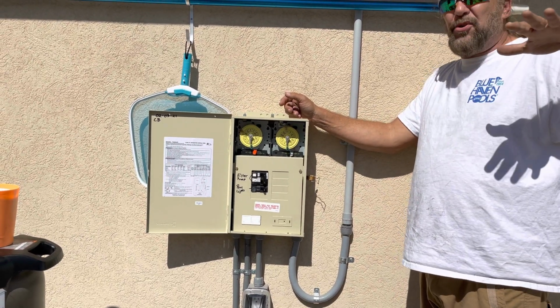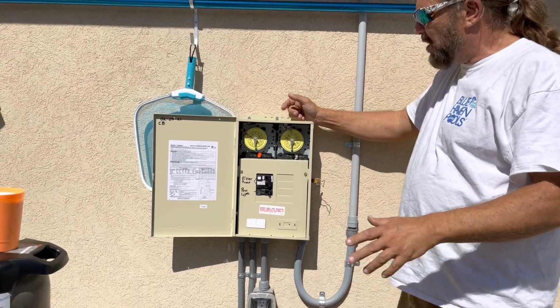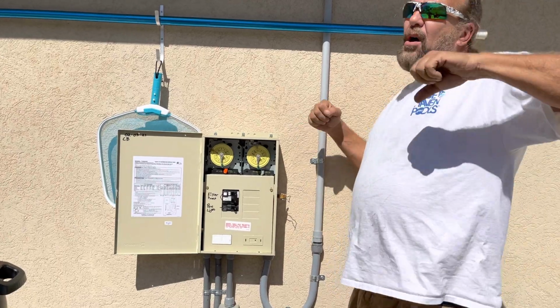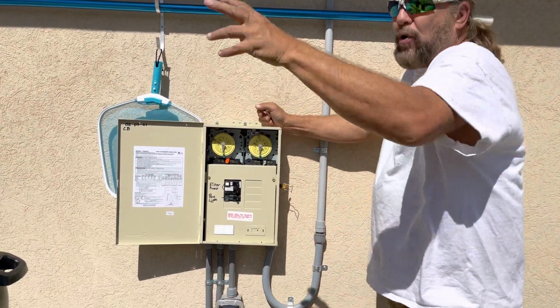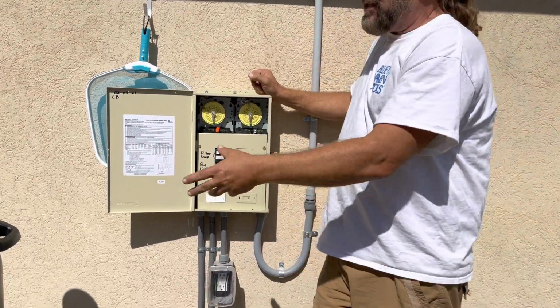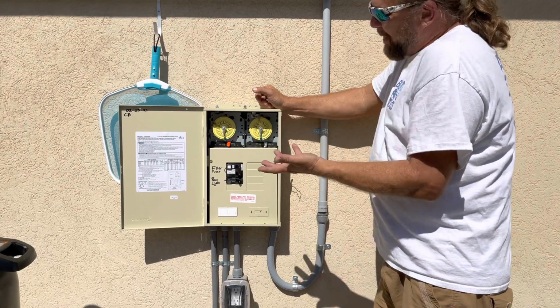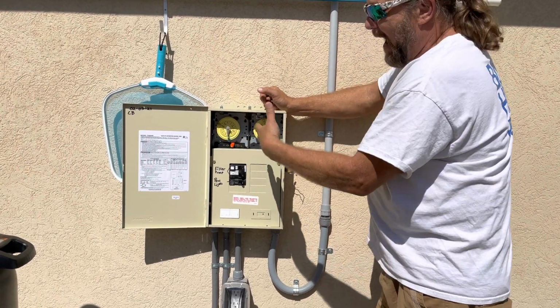So they also say you want to do it during the hottest times of the day, almost like the food temperature danger zone. Food sits out in that 70 degrees, it starts to grow, you know, salmonella, botulism and stuff. Pool's the same way. The hottest times of the day is when the bacteria goes, oh, I want to grow and turn into an algae or a bacteria, okay? So you want to be filtrating, chlorinating, sanitizing, going through a filter during the hottest times of the day. So they say the minimum amount of time you'd set a pool would be from 10 in the morning till 6 at night, and that'd be an 8-hour run.